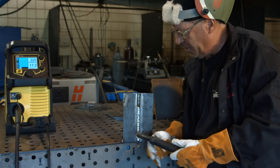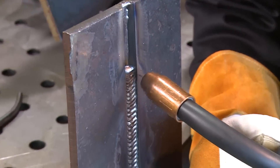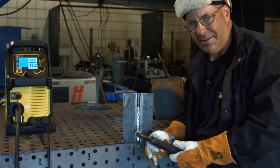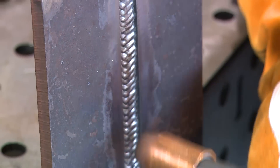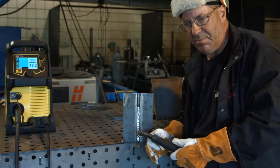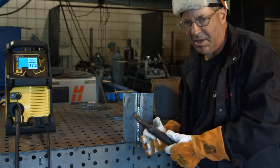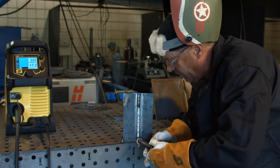This is my fill pass done on this three-eighths plate. I put a downhill root, did a fill pass up about two-thirds to three-fourths of the way so we could show all the passes, and now I'm going to put my last pass — the cap. I have cleaned the glass and silicone deposits out of the weld groove, and I've wire-bead-brushed the mill scale on the outside of the plate. I want to use the beveled edge as a guide, so I'm not going to be weaving outside of the groove. Again, this is just a test — it's not normal to run .030 wire on this big of a bevel groove, but I'm just trying this machine on the 110-volt side. Here's our cap.